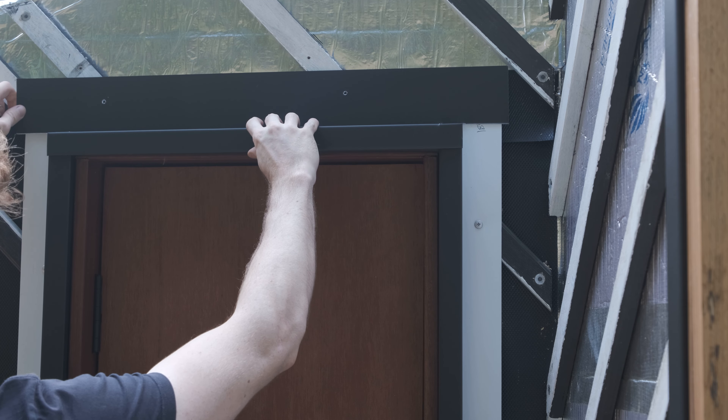Each of these panels are held in place by separate stainless steel clips that are screwed into the battens below. These panels also have a seam between each one that plays a big part in their aesthetics. In order to make this roof look nice I'm trying to line up the panels so that there is a seam in the middle of the roof. As this is such a small area I found getting the middle panel in place first was easier. I'm leaving the panels oversized when I place them rather than spending time measuring and cutting them down — instead I can scribe the edge to the underside of the panels for a perfect fit.